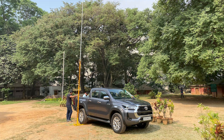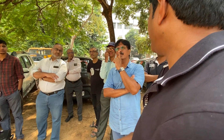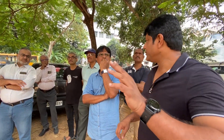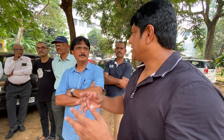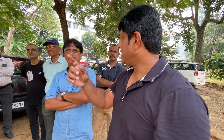That orange part can actually go to 40 feet when fully telescoped out. It has got a pulley on top with a hook where I can tie an inverted V antenna, and I've used it a lot for my G5RV antennas. In this case at 12 feet feed point, I've put the 17-foot 20-meter tube-in-tube antenna. The mast was made only to get my antenna up to 40 feet — where there's no tree, like in the desert when I operated. This came in my backup truck, and I took the orange mast up to 40 feet and hung a G5RV there.